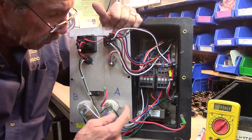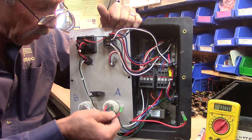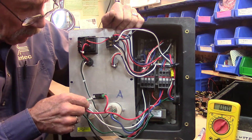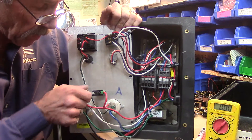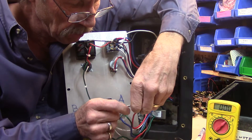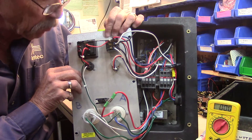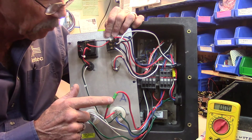Let's talk about the agitator a little bit. The power comes in off this receptacle right here for the agitator. One of the hot wires goes through the circuit breaker right here. If you think that there is a possibility that the circuit breaker is bad, as in your agitator motor is not running correctly, pull these off. Interlock and slide the corners of them together for test purposes. Don't let them touch anything. Turn it on. If your agitator motor runs, you've wired around the circuit breaker. Never run like this — use this only for test purposes.